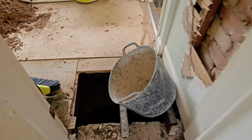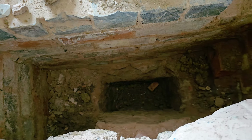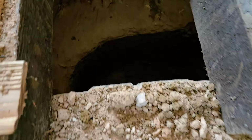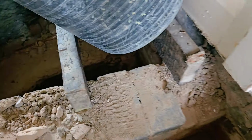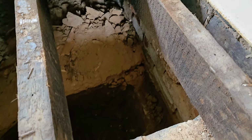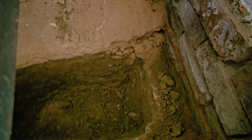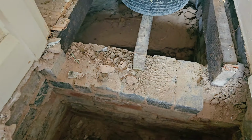A house footing is crucial because it provides a stable, level foundation that evenly distributes the weight of the structure, preventing issues like shifting, settling, or structural failure. It anchors the building into the ground, reducing the impact of environmental factors like soil movement or frost heave, which can cause damage over time. Footings ensure that a home or building remains safe, durable, and compliant with building codes, ultimately supporting its longevity and reducing the need for costly repairs.